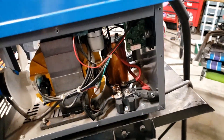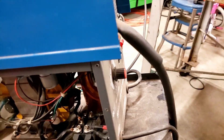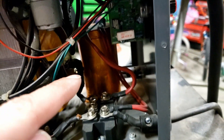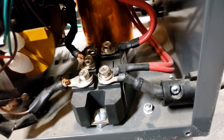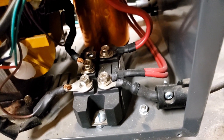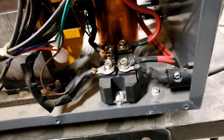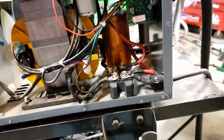We just had to take a little break — the Harbor Freight flux core welder stopped welding. I had to look into my modification where I converted it to DC electrode negative from AC, and it looks like I may have fried one of my diodes. They give you an extra diode on these rectifiers so I switched it over and it looks like it's welding good again. Put one on order, might have to go buy a real welder tomorrow. Let's continue welding and see how it goes.